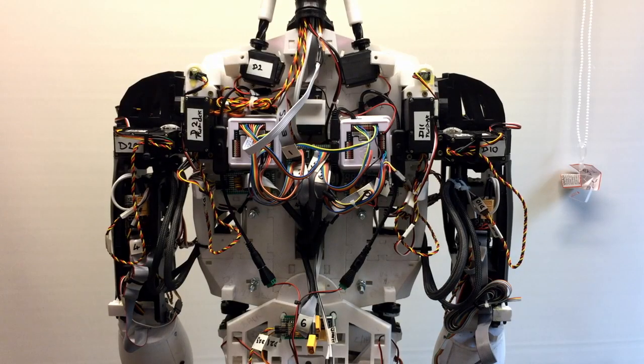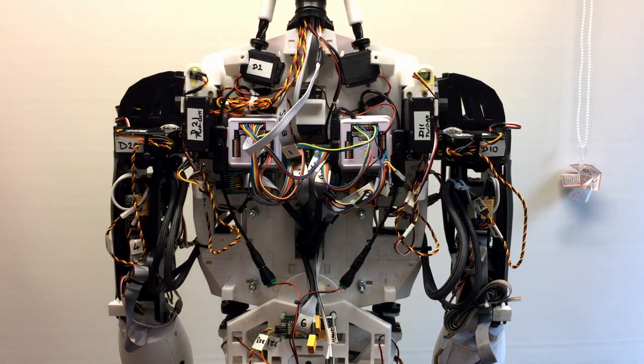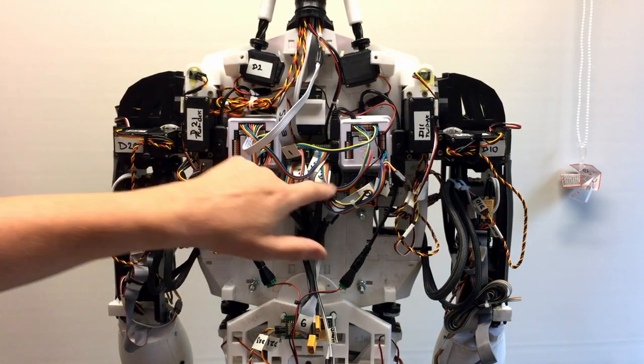Okay, this one with the rewire of the InMoov power. I used to be running it at 5 volts. I've now bought a new 12 volt power supply, a 30 amp power supply. I actually bought a 40 amp, but it was faulty, so I'm back down to 30 amp. And I've now properly installed the EasyB 2 control units. I've got obviously one here which is board 0 and that's board 1.